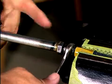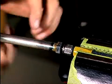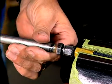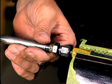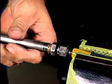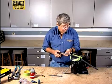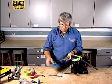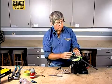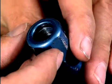In this case it's going to take a nine-sixteenths wrench because we're doing a number four hose installation. And once we get that tight, we're going to be able to just back out this inner sleeve. As this comes out, you can see it slowly threading itself out. We can see what we've got here — looking at the inside of this body right here.